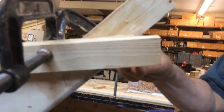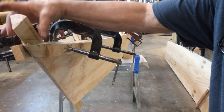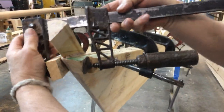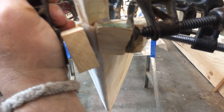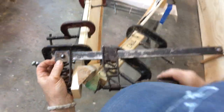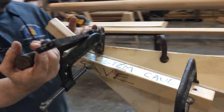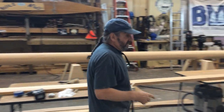We've made this tool over here — take a look at this. It's called a CAUL, C-A-U-L, because it's hard to clamp with all these angles. I just cut this scrap piece of wood and we can put a clamp on here — it'll stay there — and clamp in this very front end. Otherwise it's tricky to do. I'm going to do the same thing on the other end using one of these clamping CAULs — just a little piece of wood that we use to make different parts of this easy.